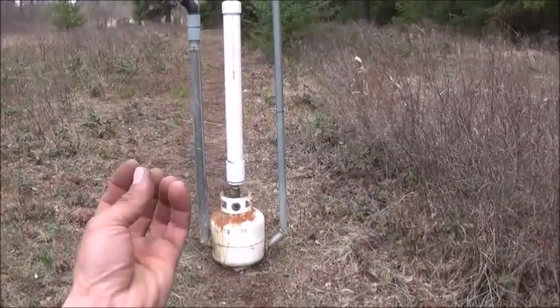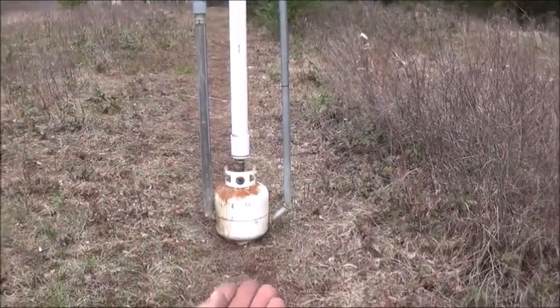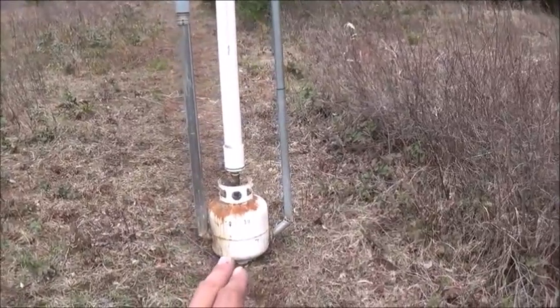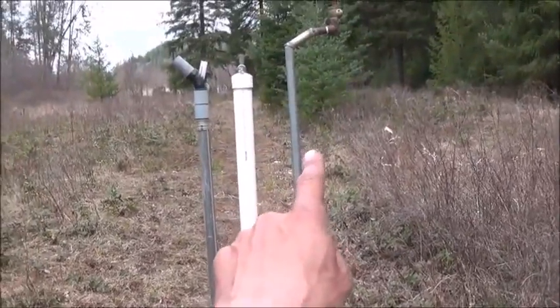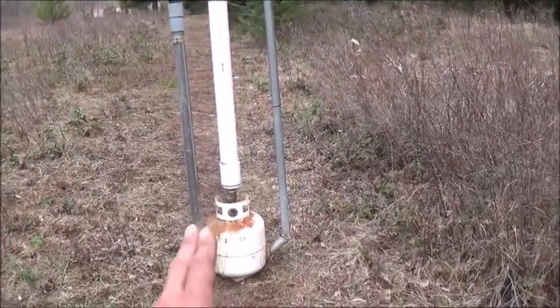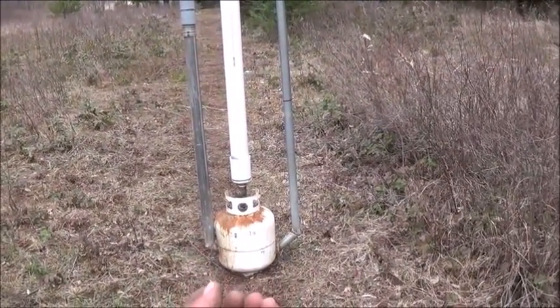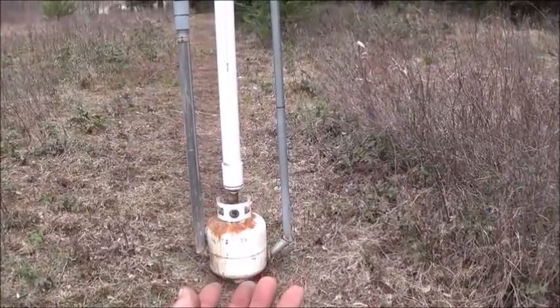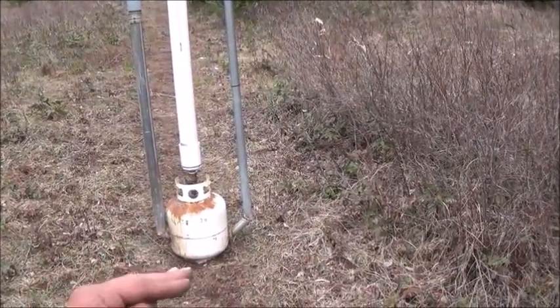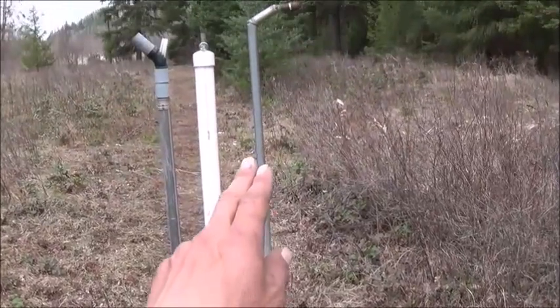It's going to flow down the pipe carrying all those air bubbles with it, hit the bottom down there where the propane tank is. The opening for the pipe end is slightly higher than the output pipe on the other side. Water is going to flow in, grab air bubbles, go into the propane tank, spin around and get swirled together, releasing the compressed air that's in that water. The water is then going to go down out of a pipe lower than the input, flowing all the way up this pipe.